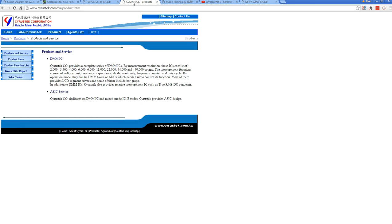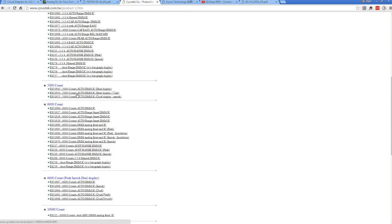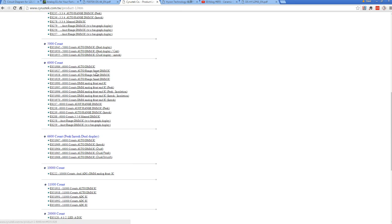Anyway, there's Fortune Semiconductor, and then there's Cirrus Tech. They're very popular in a lot of the Chinese meters, and they've got basic 2,000 count ones, 3,000, 4,000, 5,000, 6,000. Now, if we were looking for a chipset for the BM235, it's a 6,000 count multimeter. So it could certainly be one of those, and there's many to choose from. Once again, there's the smart DMM ones, which are the complete processor, and then there's just the front end ICs and things like that. So it could certainly be a Cirrus Tech.